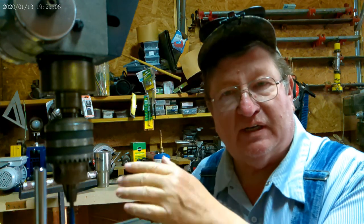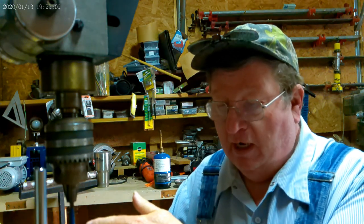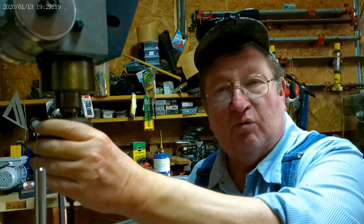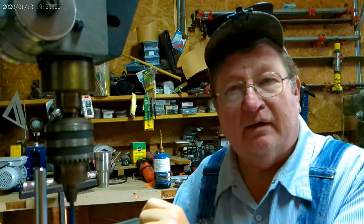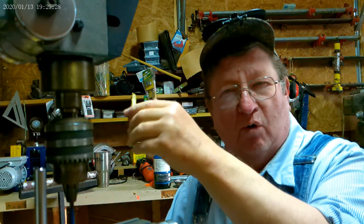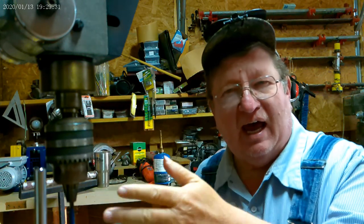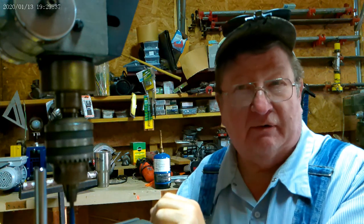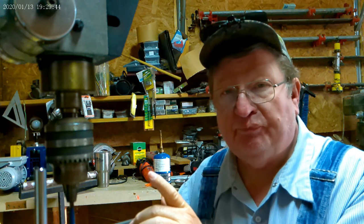And so today, we're going to attach the drill press table. We're going to attach this crossfeed table to the drill press table, and then we're going to work on a couple of other pieces of metal and see if they'll work without pulling this chuck out. That's what I'm mainly concerned with. I'm concerned that this Morse taper chuck will, when you start milling something coming from the side, just shake too much and fall out, and we'll have to put a collet up in there. So we just have to wait and see how that pans out. So I'm going to get this table ready.